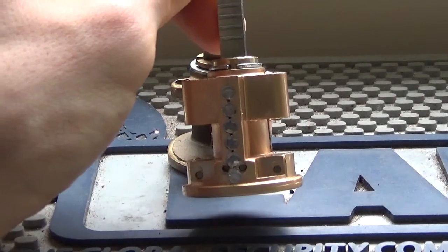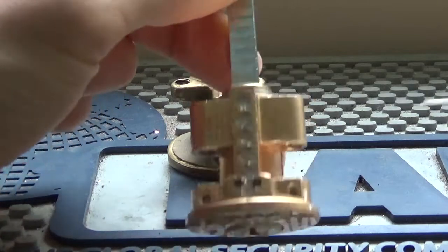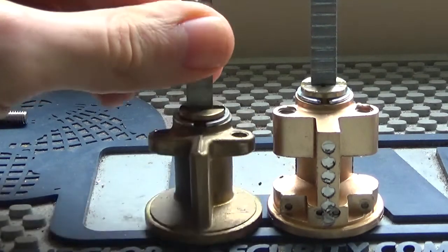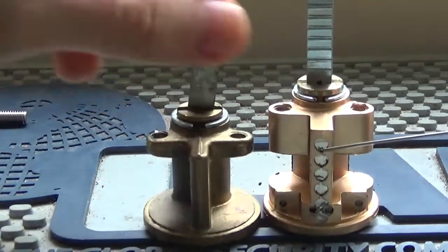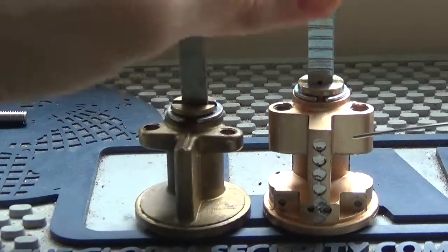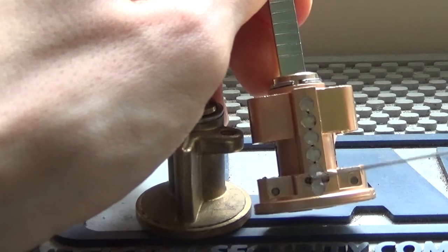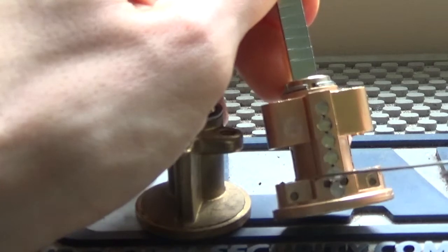Now we can see, let's get our pointer, and just go side by side comparison. This one we can see no drill resistance. Clearly there's 6 pins in here, and we know there's 5 in here because you can see the 5 holes. No drill resistance. Anti-drill pin here, anti-drill pin there, pins there to protect the pin stack, and another anti-drill pin there.